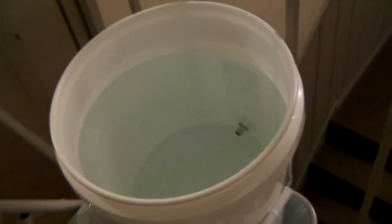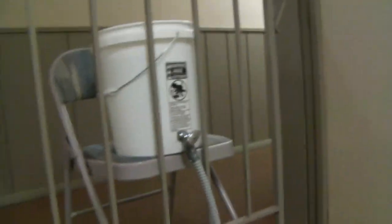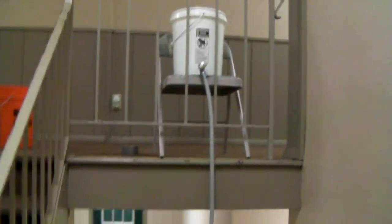This is a 5-gallon bucket with a valve installed. It is placed at the top of the stair so that the water gains the gravitational potential energy it needs as the source of power for our hydroelectric generator. We have approximately a 7 to 8 feet difference in height. The water pressure at the bottom of the bucket, created by a water height of approximately 13 inches, also provides a force in addition to the force of gravity. This energy is then converted by the turbines.